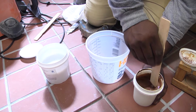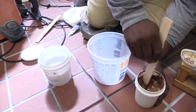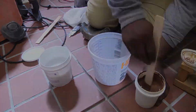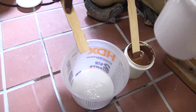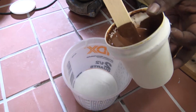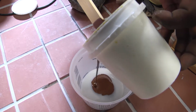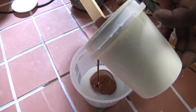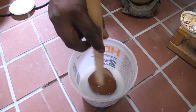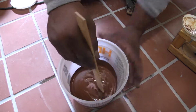You always want to mix the hardener up before you pour it into the resin. Some of the pigments may settle. This is a 100% solids material, and you cannot use a sponge to wipe it down like you do with Marcoat GS. If you get any excess on the tile, the way you clean it off is with a rag with acetone.